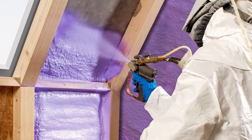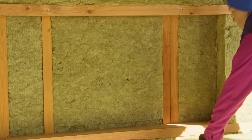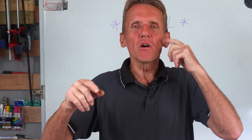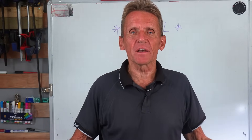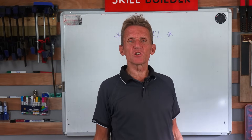You might think this is just scaremongering, or that I'm being paid by foam installation companies — but actually I've already got a video on our site saying I don't even like the stuff. If you're going to avoid putting it in your house, I think you're better off using some other form of insulation, such as PUR board or even better still Rockwool, which is fireproof and a wonderful product. Even the fibres have been suppressed so you can put it in without masses of fibres everywhere. The biggest advantage is it seals all the gaps and draughts, making an absolutely cosy, airtight blanket around your house — if indeed you want an airtight blanket. And we have another video about airtightness in buildings and the mistakes people make there.